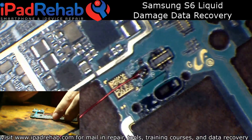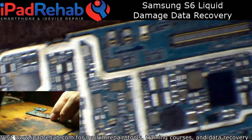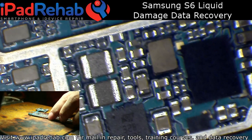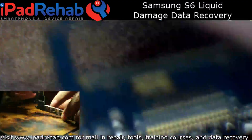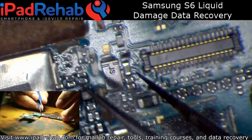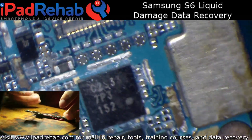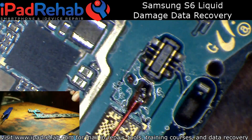What I've already done is just inspected it. It looks like it's already been cleaned, but I can still see some pretty clear signs of where there was liquid. I've attached a wire so that I can power from the DC power supply, and I'm going to do that now and see what I get.